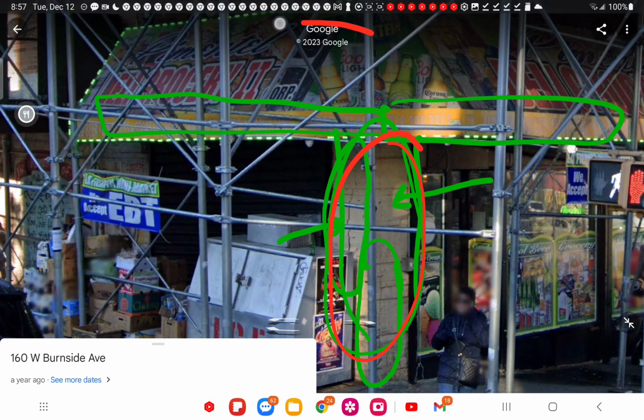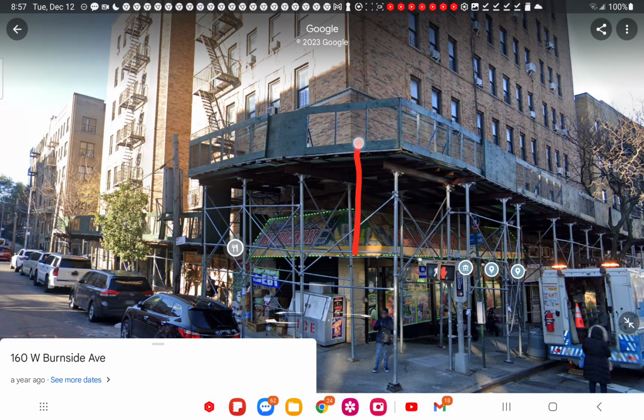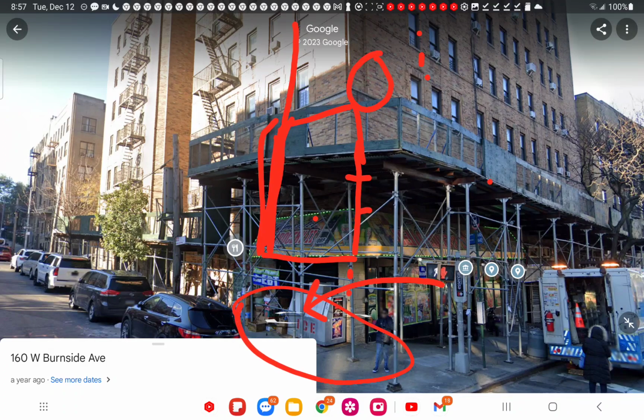But now that first layer of brick, this big chunk of brick, if you will, it's pretty significant before you get to the first window. I think it's somewhere like that. No, is that right? Yeah, there's no windows up here, so it's pretty significant. All right, so let's call that a big section. And as this guy cranks down, it drops down and fractures the plane here. Here's our plane, and there's a continuation of the plane. It's not self-supporting. It takes a rotation this way a bit to our left, pulling on the bricks that were interlocked at the corners, pulling these bricks towards this stockpiled area here. Some of it did push the scaffolding out. If you look at the profile of it, some of the scaffolding's pushed out into the street.